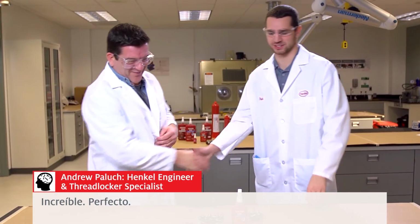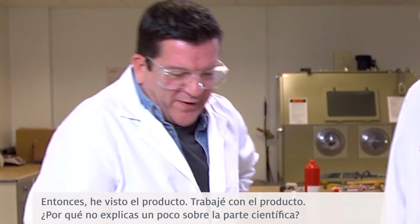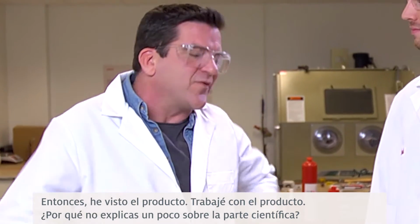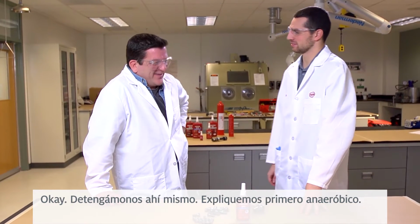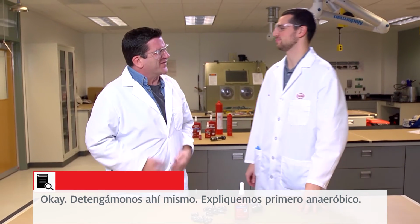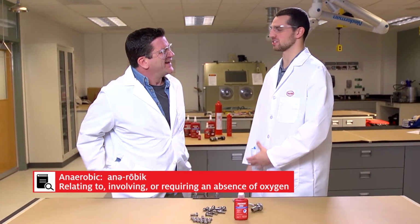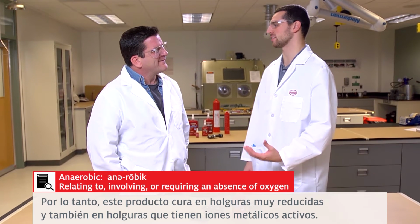Awesome. Yes, let's do it. Great. So I've seen the product, I've worked with the product. Why don't you explain a little bit about the scientific part of it? Well, a thread locker is an anaerobic adhesive. Okay, let's stop right there. Let's explain anaerobic first. So anaerobic means without oxygen. So this product cures in very tight gaps and also in gaps that have active metal ions.